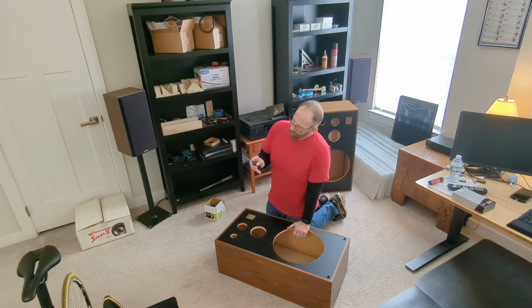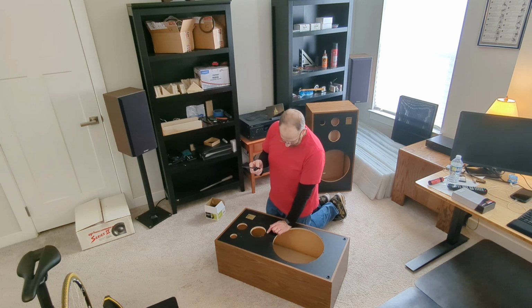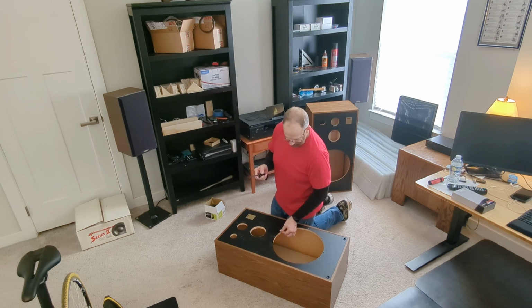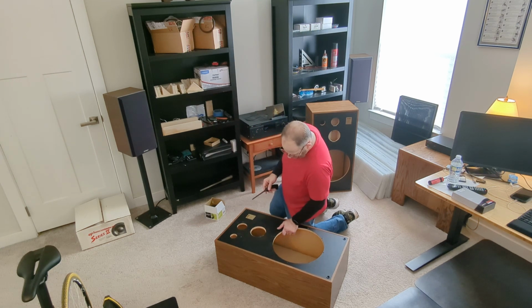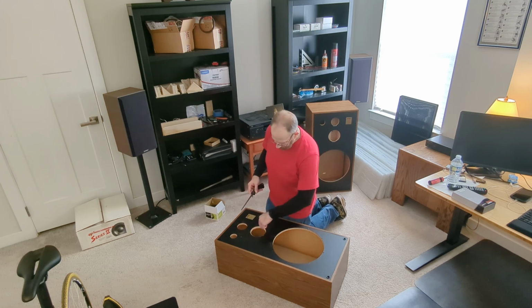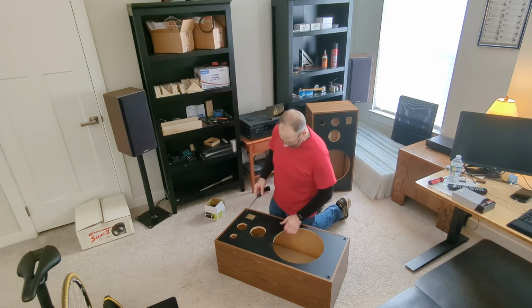So, to get going, I'm going to just try lightly pushing and pulling so I start getting a cut. This black stuff on top of here is actually like a thick, not a contact paper, but almost like a glued on piece of plastic. It's kind of textured, and it does kind of flake and break easy, so it comes detached. So I have to be careful of that. Most of my cutting and filing is going to be going inwards, so I'm cutting it off that way. I'm not pulling it this way, which would make it peel back.